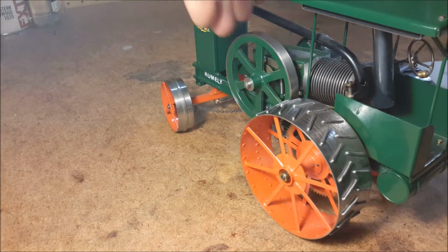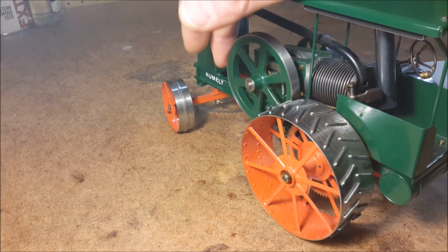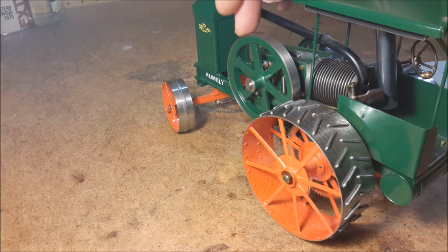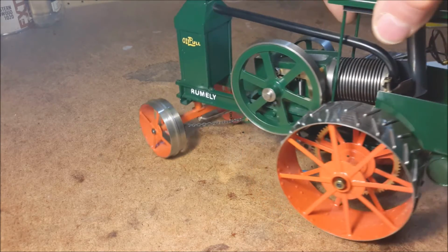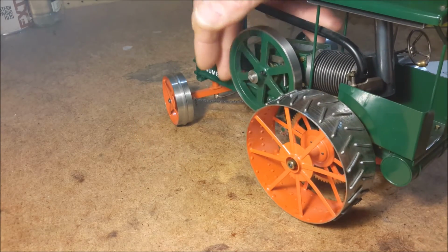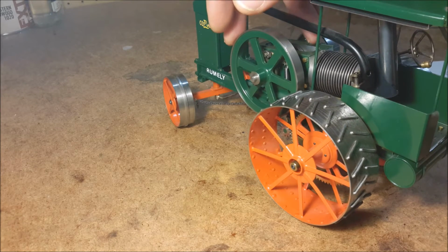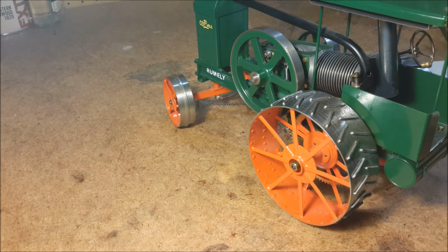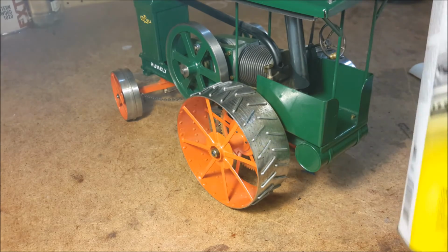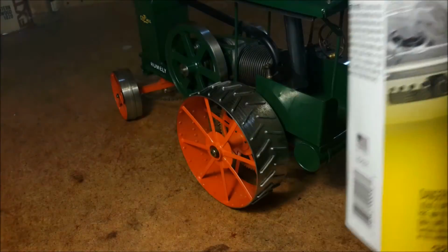Well, that's why it's called an atmospheric engine or a flame sucker. The flame, of course, is air and combustion products at a very high temperature, which means it's greatly expanded. So when it's sucked into the cylinder and the little door closes, like that, when the door closes, that's when the partial vacuum is created in the cylinder. And again, like I said, atmospheric pressure pulls the piston back to the top of the cylinder. I've been using denatured alcohol for fuel.